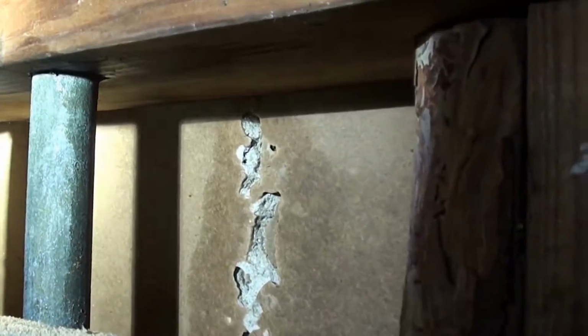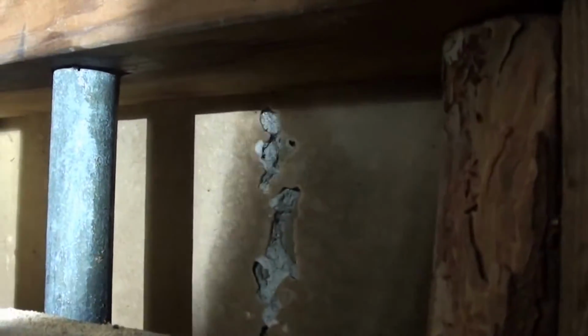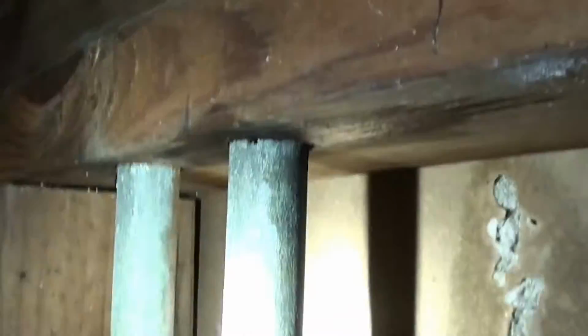We're just sitting here hanging out talking about it, and I get to looking and I see the drywall. This house is funny. They put up drywall and then did the plaster, so it must be a way they did it in the 60s or something. But anyway, I got to looking at that drywall over there, and it's obvious. I would have thought maybe bugs had eaten it if it didn't look like it was wet. So then I reach around that pipe and I can feel a crack on it. That means this section going from here to the basement is damaged.